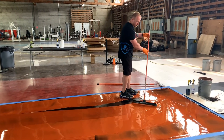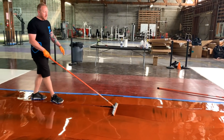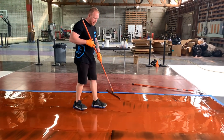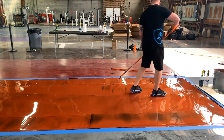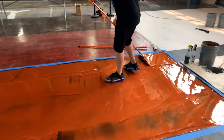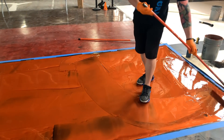It's going to level out the floor the rest of the way. The squeegee does most of the work. If you don't use a squeegee and you just try to level out the floor with a roller, it's going to take you a really long time. Now that we pretty much have it spread out, I can kind of see some thick spots — like right here I can see the black primer through, and there's a huge pile — so I'm just going to spread it out a little more and fill in those areas. We want to do most of our work with the squeegee, not with the roller. The roller is simply just going to help level it out.